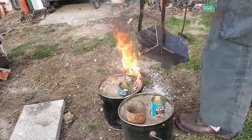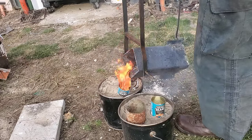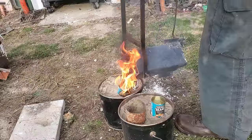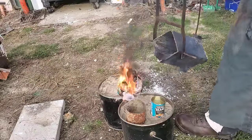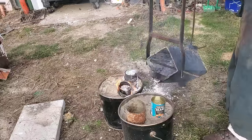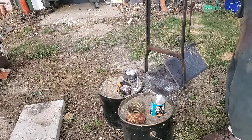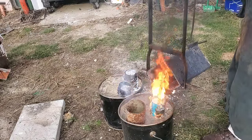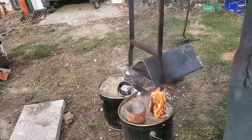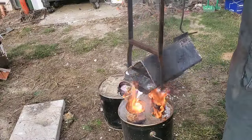Casting obviously can be dangerous. So if you decide to do this as well, make sure you wear the proper PPE — not only the proper apron and boots and what have you, but also the right respirator and gloves. A lot of this foam is kicking off some really nasty chemicals if it's incompletely burnt, and that's why I have an organic respirator on.